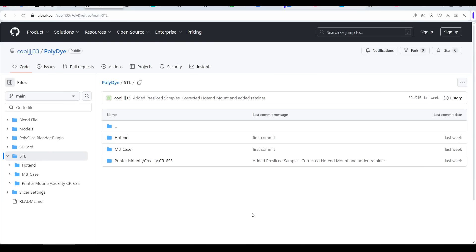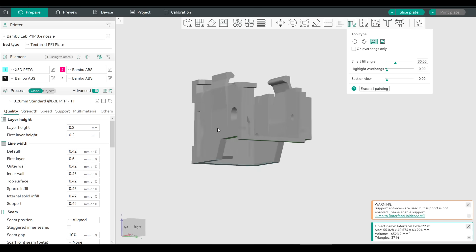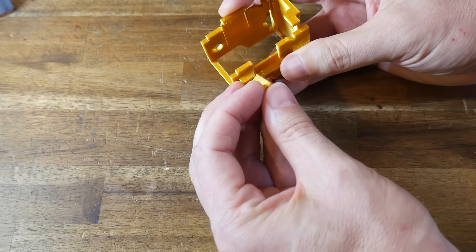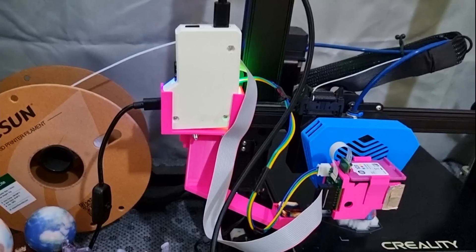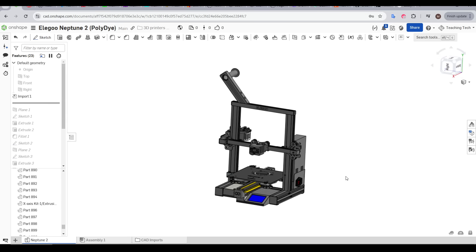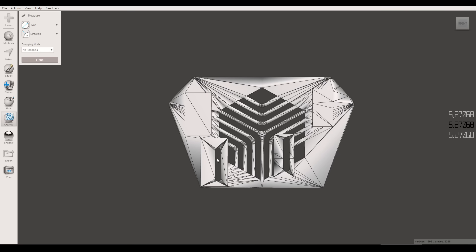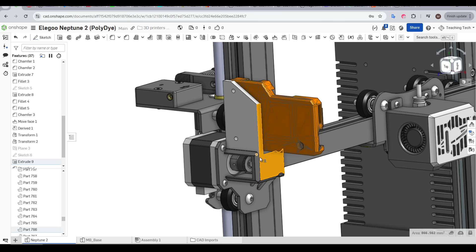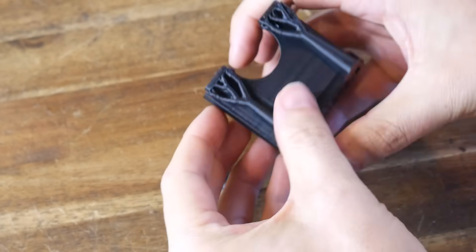On the GitHub, we have some printed parts for mounting the various components. Pretty much all of them will need some sort of support, and I'd recommend placing it manually to be as precise as possible and avoid waste. You need to use some filament with a little bit of flex for this to function properly — something like PETG or ASA, as anything more brittle has a chance of snapping. There are two mounts customized to the printer, available for a Creality CR6, but in my case I had to design my own. Fortunately, the Elegoo GitHub has a full 3D model in various formats available, and a guide will be provided for those that need to design their own mount with critical dimensions.